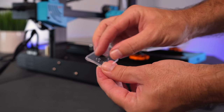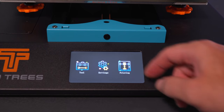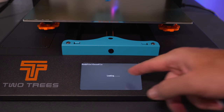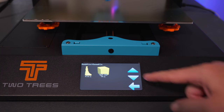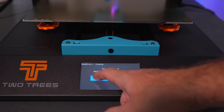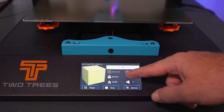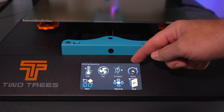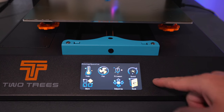Let's grab the micro SD card and plug it in — right side up on the left side of the printer. On the main screen, click Printing. It said no files found at first, but when I took the SD card to the computer there was a zip file — you have to unzip it to get the folders. One folder has test files: a 20mm box and Elsa. Let's start with the box. Clicking it shows a preview, progress bar, time elapsed, Z position, temperatures, fan speed, and quick buttons for Pause, Stop, and Options including temperature, fan, filament, speed, and baby step controls.